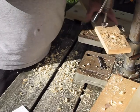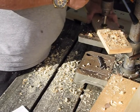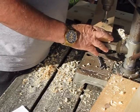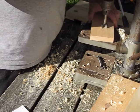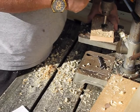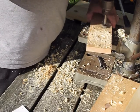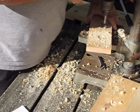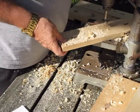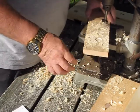Whenever you're using a drill press, you want to focus on what you're doing. It's one thing to drill holes with drill bits that are maybe up to a quarter of an inch or even a half an inch, but once you start getting over half-inch drill bits, it's an entirely different situation. Keep your hands away from the bits. Make sure that the long end — on my left here — if the bit catches and starts to spin the work piece, that it swings into the barn.